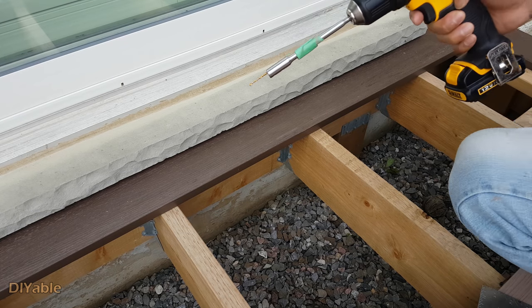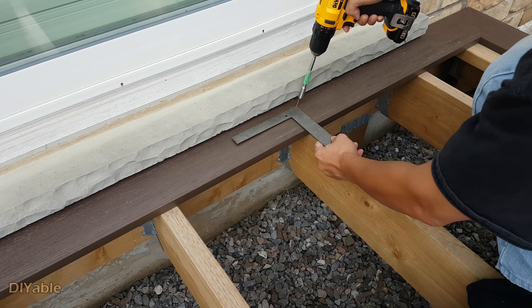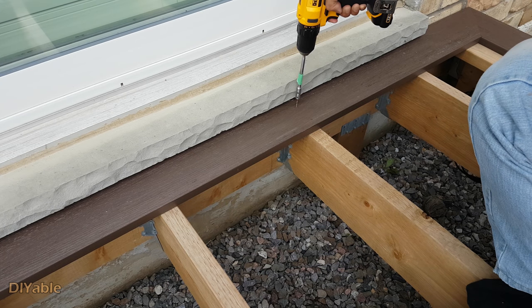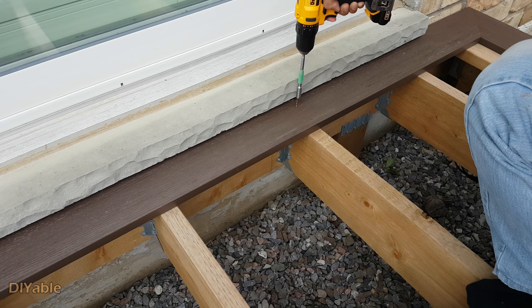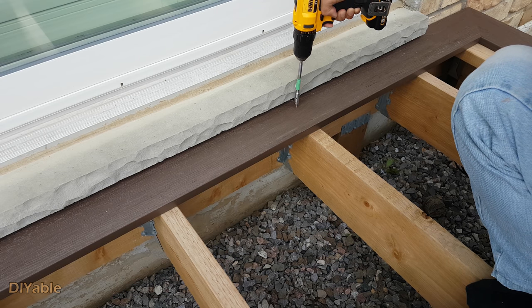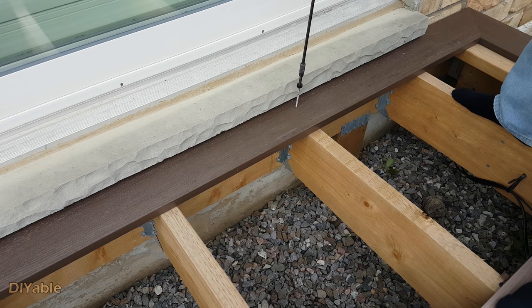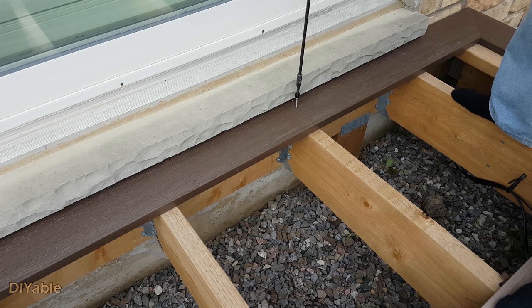This is the solid board next to the house under the stone sill. It is very tricky to install because there is not enough space. I am using this drill bit extension — it worked. Next, I used a driving bit extension to get the screw as close as possible to the house.